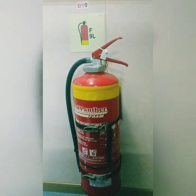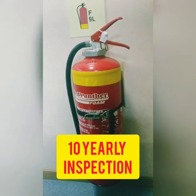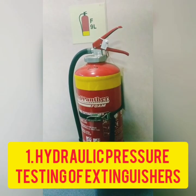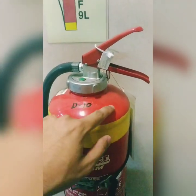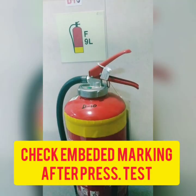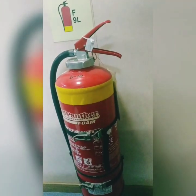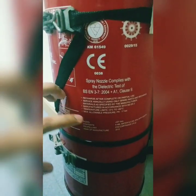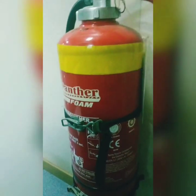After five-yearly, the next inspection schedule is ten-yearly. As per the requirement, at the ten-yearly inspection these extinguishers have to be hydraulically pressure tested. They have to be landed ashore, and once received back after pressure testing, you will see an embedded marking on the body indicating it has been pressure tested up to a certain bar value, along with the day, month, and year. You can see here the maximum allowable pressure is 17 bars, so they will be pressure tested up to 17 bars.